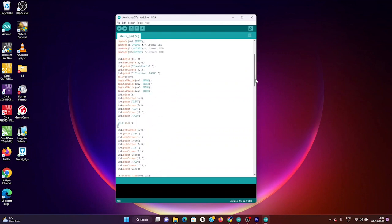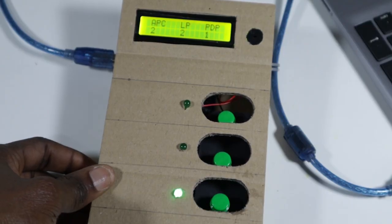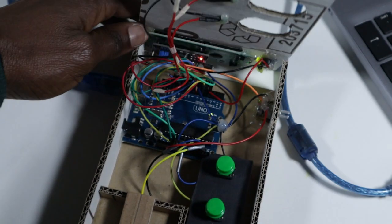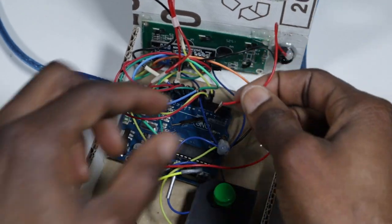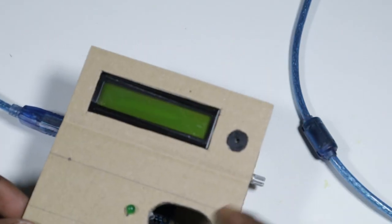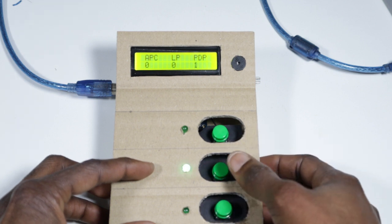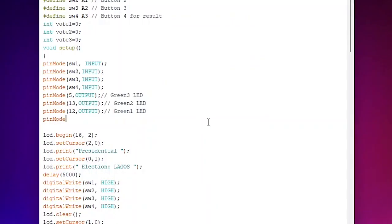This is the code. After connecting the code to the voting machine I decided to give it a try. When I clicked the first button I discovered it wasn't beeping; I clicked the second one — it wasn't beeping; and the third button — it wasn't beeping either. I had to change the port for the buzzer, thinking maybe that particular port was faulty. But the same problem persisted, so I had to check the code. There was a mistake: I hadn't included the port as an output for the buzzer. I corrected that, and now I guess all problems are solved.